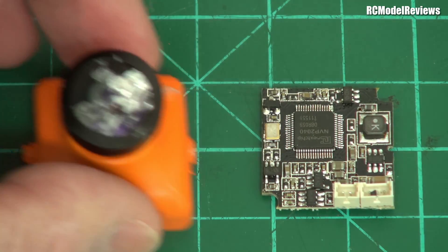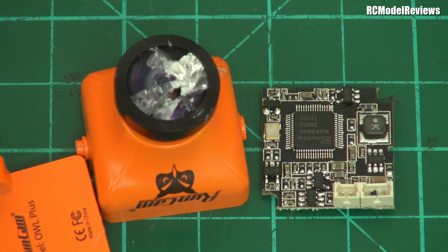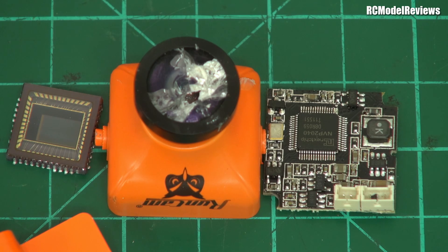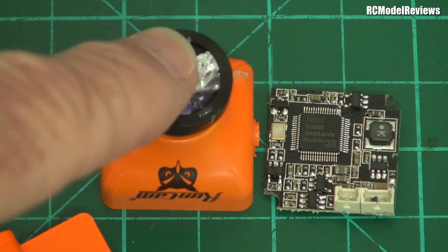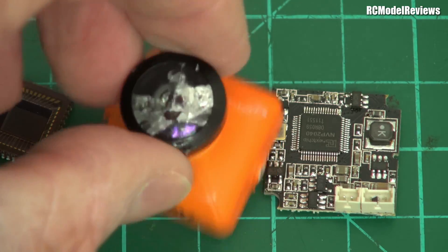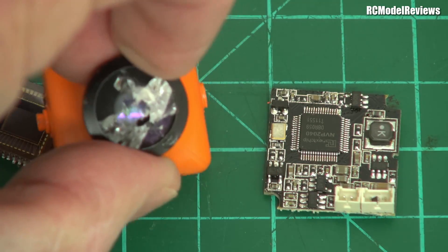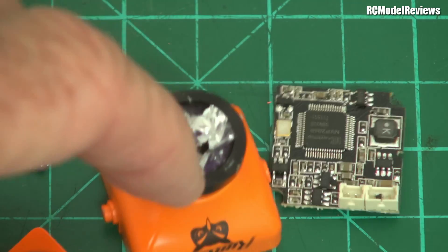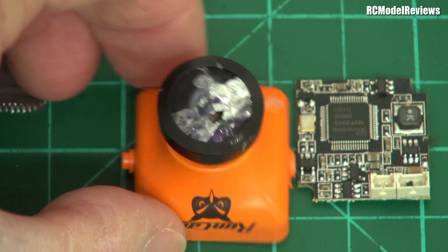That's the end of the Runcam owl — it's the sensor that did it. Questions and comments in the usual place. If you break stuff, do you usually pull it apart and have a look? Because I think it's really important — we've learned something today. Epoxying around the sensor is really a good idea if you're going to risk this sort of damage to your camera. I can't even use that lens on a good camera — actually, I think it's just the protective outer glass that is broken. You could probably chip that glass off, because that is not actually a lens — it's just a protective slightly domed piece of glass. The actual lens inside might be okay, but for the money, why would you bother?